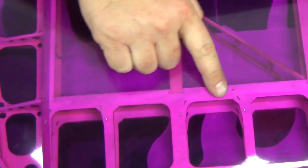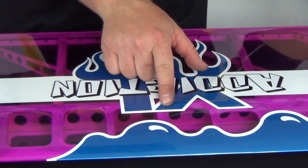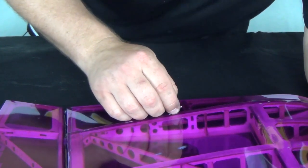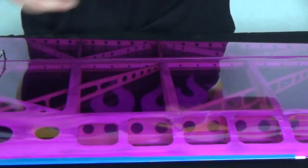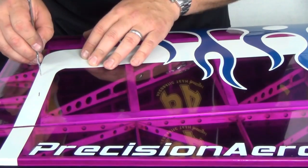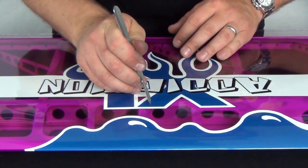Since the undersides of PA's wings are transparent, the corresponding laser cut slots are mostly visible. For incisions that must be made through the opaque covering, a long needle can usually be passed through the bottom slot and visually guided through to the top side, marking out where the incisions should be. For occasions where this isn't possible, you can use the tabs of the VGs to approximate the locations, or feel for the corresponding slots. Take your time here to avoid any unnecessary holes.